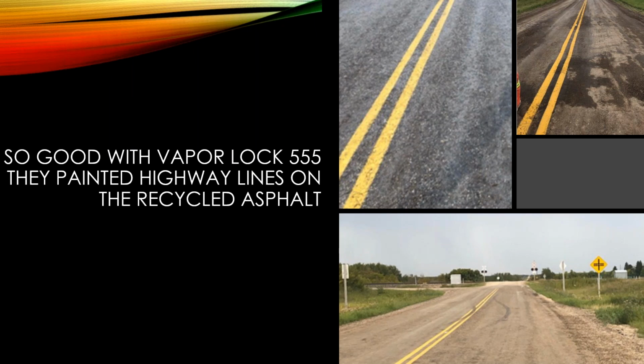Yeah, Scott, another really great thing to point out is the recycled content of concrete or asphalt instead of just granular applications. If you're bidding a job that has demo on it, tear that concrete or asphalt out, but stockpile it. We can repurpose it, reduce our carbon footprint, put in roads, secondary roads, lay down areas in your projects, trailer areas for your projects without you having to spend a penny to haul that material off. And look right here, somebody stepped on the gas pedal hard and didn't ravel up any gravel out of it. And we've been back to examine this road, very positive results.